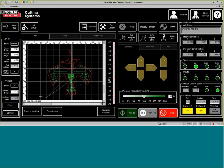Make sure you have your earplugs in because it is loud. If you have a water table, then I definitely would recommend making sure that your water is all up to the material, and get some heavy pieces of material to hold down your plate because it will vibrate the plate around. And we want to make sure this thing looks good. Now, with the intensity of the plate marker, you'll get different results. Different speeds will also get you different results for this project.